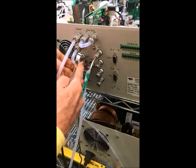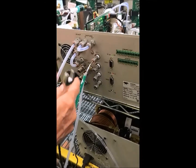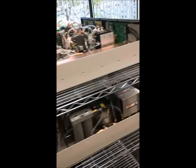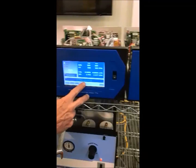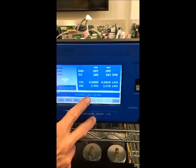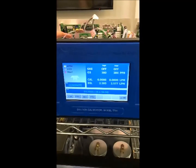These three I'm taking off because one feeds a vent, one was capped off, and this one goes over to our analyzer. The last one loops back into the photometer — we have to leave that one in place. Now we'll go back to the front and see how much back pressure is coming just from the calibrator itself. Now we have 28.6 and it's staying right at 28.6, so there's no back pressure associated inside of the calibrator.